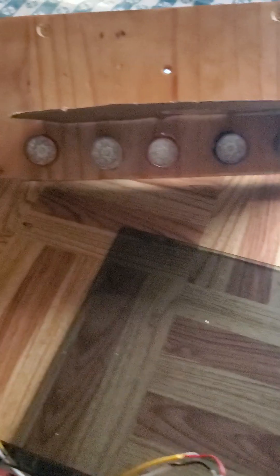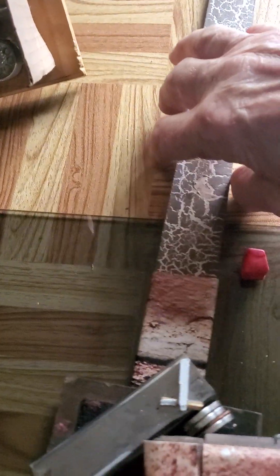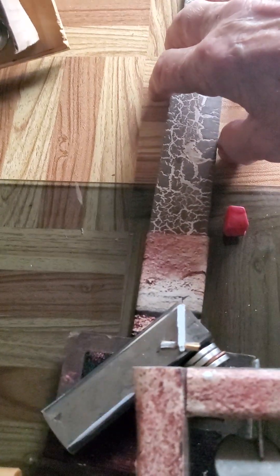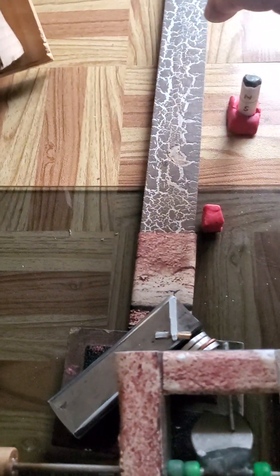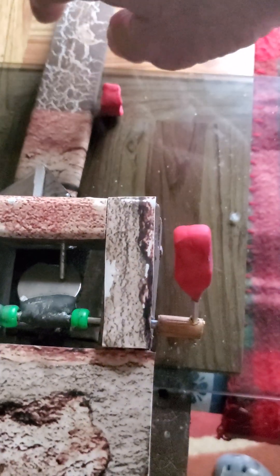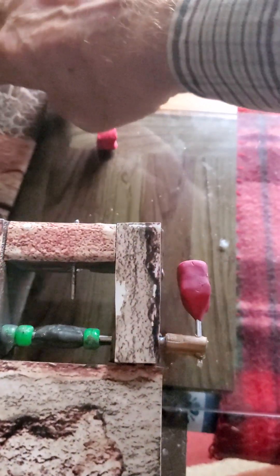They're not firing to maximum brightness, but they are firing. So the purpose is to see if I can move this arm in and out of firing position to resetting with very little force and having a greater force to fire the lights. I have a little resetting weight there that resets it. There's a drag on the motor, so it doesn't really come down freely by itself — that's why I put that little weight there.